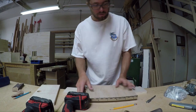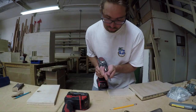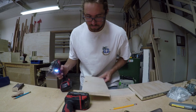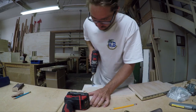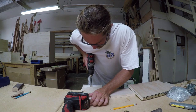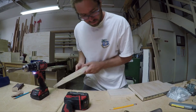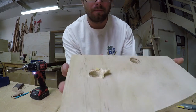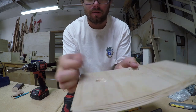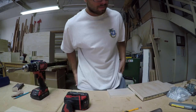Let me show you why I use this extra piece of wood, which is handy not only in this project but in all projects of drilling a hole, especially with a spade bit. I'm going to take this scrap piece and start drilling it — watch what happens if I don't have this extra piece of wood here and I keep it hanging off the table. Look at that big old blowout. Not clean. The inside's super rough. If that would be a finished piece, that would not fly — at least in my book. Why not just spend that extra little bit of time to make it look clean?